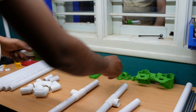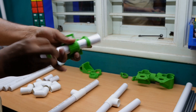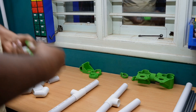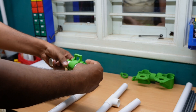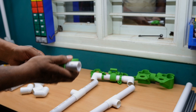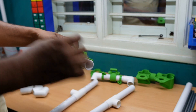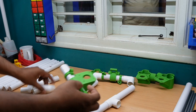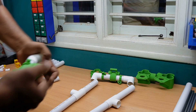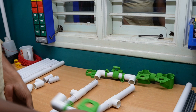One Y-axis tensioner part and two Y-axis holders. Next, two elbows — fix like this end-to-end. After that, similarly we fix the stepper motor Y-axis and two Y-axis rod holders. Next, take the elbow and assemble like this. Now the Y-axis is almost complete.